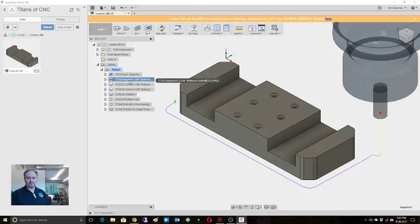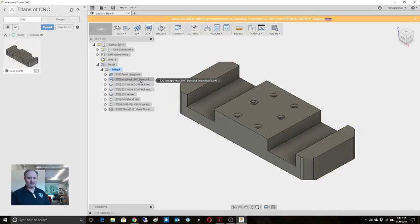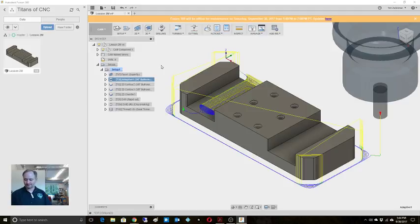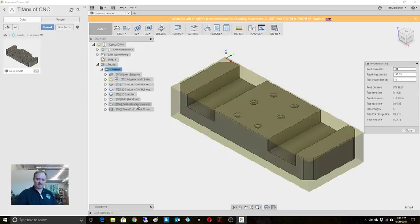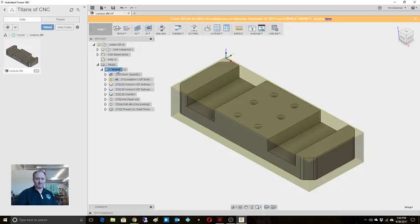And this tool path, yeah, it's not pretty, but I mean, it is pretty, actually. It shows really nicely, but this was almost optimized from the start. Now, I might be able to change speeds and feeds a little bit to speed this up. But if you look at it now, if I look at machining time, 21:15. Tool change time was 1 minute 15. So actually, this is faster. And I've eliminated a tool change.